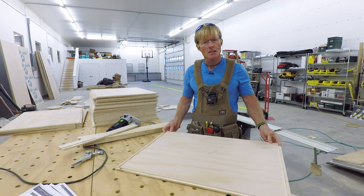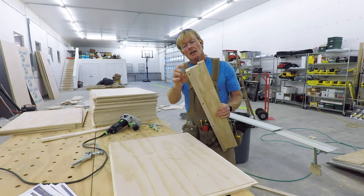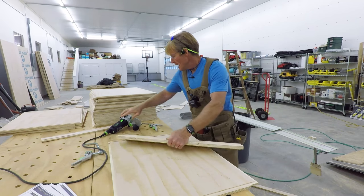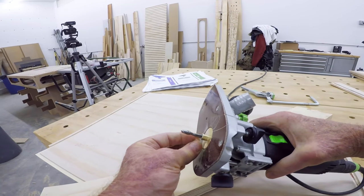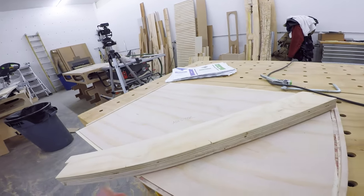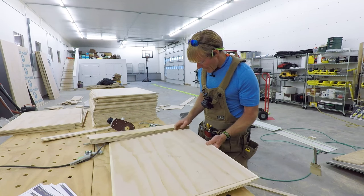This is the new design I have for the passive lock system. I simply made a jig, and this jig has the cutout for it — it's a sixteenth of an inch wider and a sixteenth of an inch longer than I actually want. That is so that the quarter-inch cutter I'm using with the pattern guide will reduce the cut by a sixteenth and give me exactly what I'm looking for. I'm just using my small handheld router. All I have to do is clamp it in the middle and hold it still — it's a quick process. I'll be able to go through all of these in about 10 minutes and it's giving me an excellent cut.